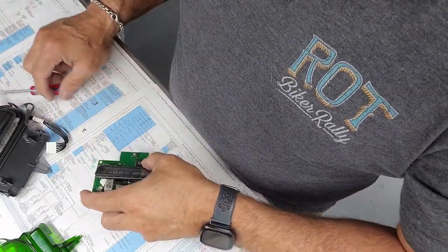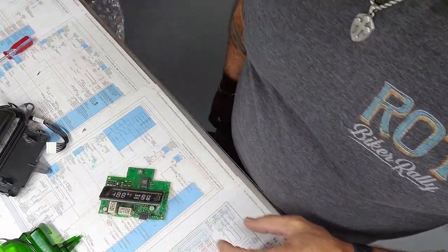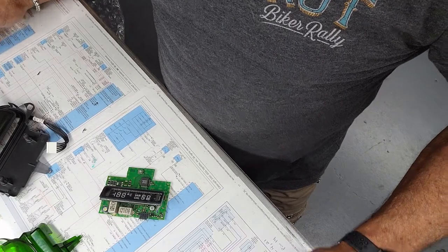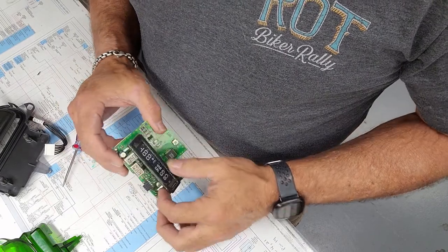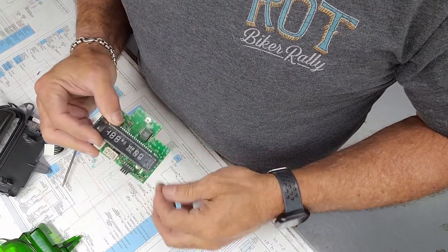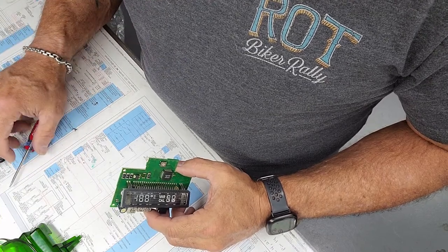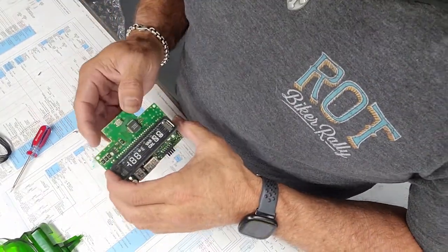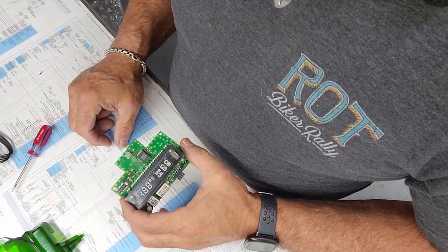get cracked solder joints. They turn completely loose from cracking and vibrating loose. Your vehicle is subject to basically, it's just a rolling earthquake everywhere it goes. So all the rattling and vibration, it just causes things to turn loose. And you know, I think OSHA has gotten to the point where, well, it definitely has eliminated lead in the solder, which makes solder a little more malleable, and we don't have that anymore. So we got all lead-free solder in the manufacturing processes, and it's not very forgiving. Doesn't last long.